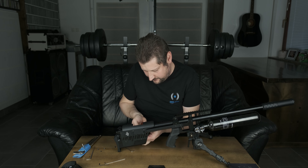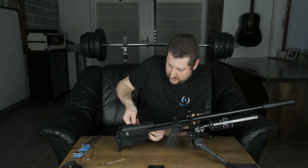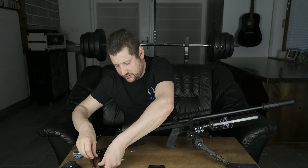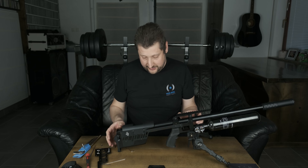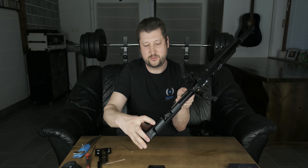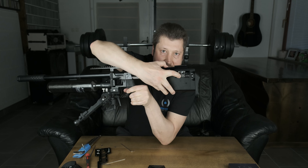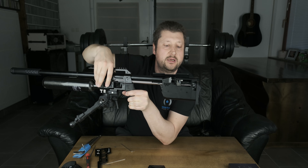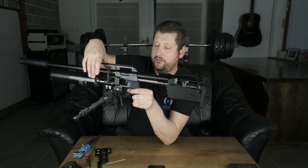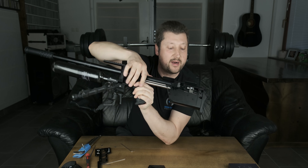There's also a small improvement to the pellet pusher. You now need a slightly bigger allen key to replace it, which is always better since small ones tend to strip. The access position is also slightly different — you don't have to fully cock the gun, just place the key in position and replace the pusher. As you can see, there's now a dedicated pin that engages the hammer, while the upper connection only pushes the pellet pusher under no force — so there's no more torque on the rear square part.